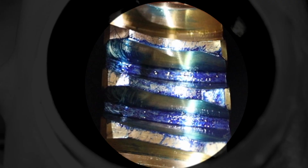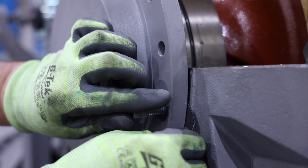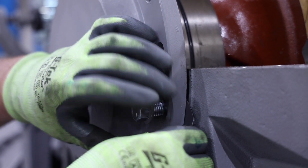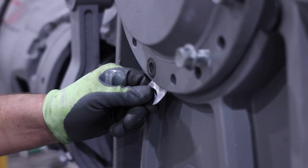The ideal pattern would be a center pattern on both flanks of the gear tooth. Note the GT series machine worm and gear contact pattern can be checked with no load on the wheel if a wet type bluing is used as shown. The pattern can be adjusted left or right by adding or removing shims under the outside eccentric mounting bolts. If shims are adjusted, repeat the bluing and pattern checking process until an acceptable center pattern is obtained that is consistent on both gear tooth flanks.